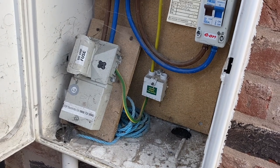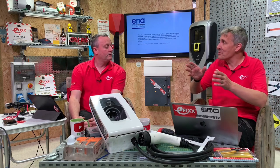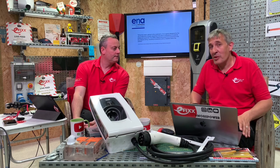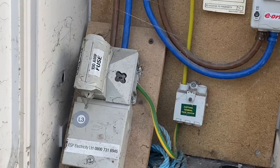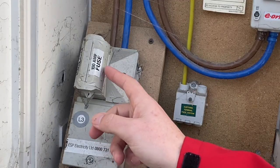One DNO went further - it's not just a no, but you're in breach of your electricity supply agreement, which states that as part of them supplying electricity you're responsible for maintaining an area to house the meter and associated equipment. The worst case scenario: they would want the equipment removed from the cabinet, and if you don't remove it they could actually remove your cutout fuse - whether 60, 80, or 100 amps - resulting in no supply to you.